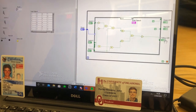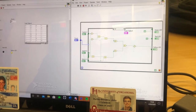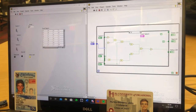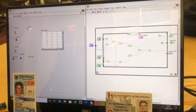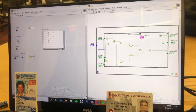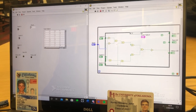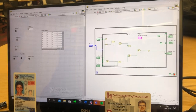For Part 6, the yellow LED is on. When switch 3 is turned up, it turns off. When switch 2 is up, it's still on. When 2 and 3 are up, it's still on. When 1 and 3 are up, it's still on. When 1 and 2 are up, it's still on. And then when all 3 switches are up, the LED turns off again.